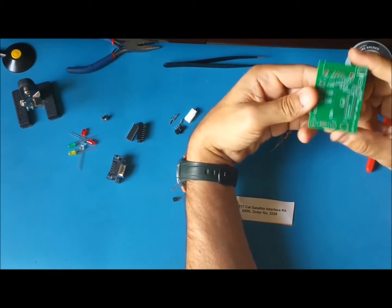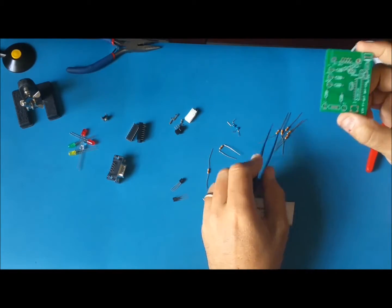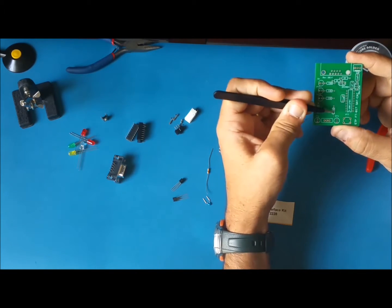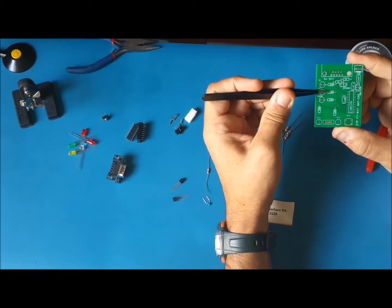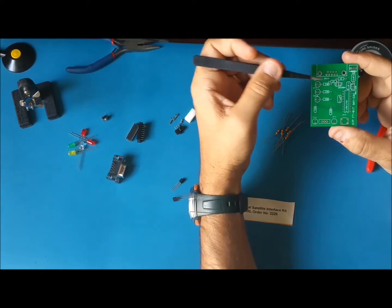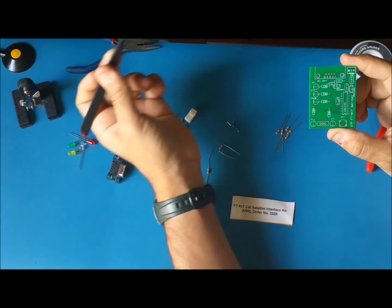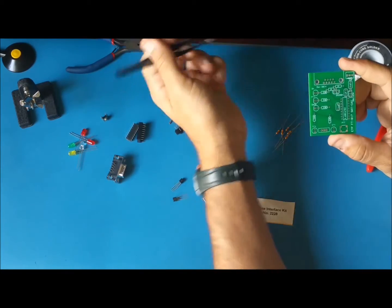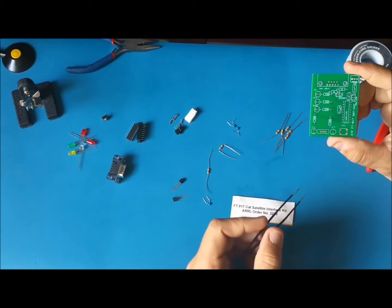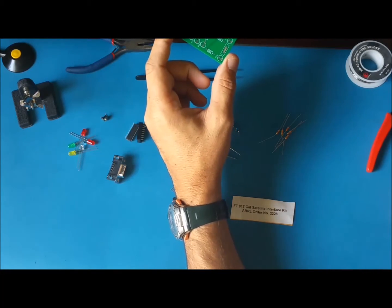Here you have 5 resistors here, and as you can see there are 5 here, so logic tells me that's where the 5 go. Then you have 2 others that are the same. Those must go here where it says 1K, and then basically it's just like filling in the blanks. Very straightforward assembly. I have my solder set at 650.